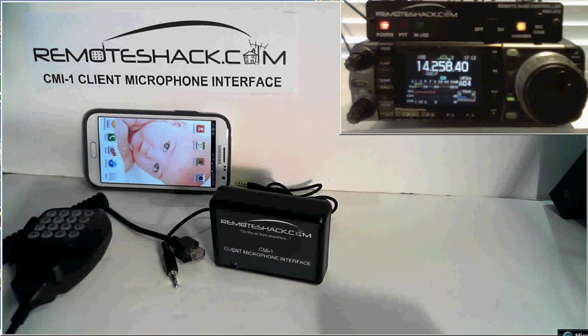Up in the top right-hand corner of your screen you'll see the radio that we are remote controlling — the remote station along with the RemoteShack controller on top of the rig. It's an ICOM IC7000 connected to the RemoteShack, and the RemoteShack is connected to a computer running Skype waiting for our call. The video output of the IC7000 is connected to a video input device which is used as a webcam input for Skype so we can see the radio when we're on the road.